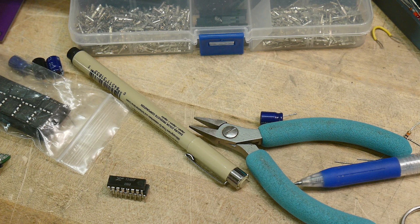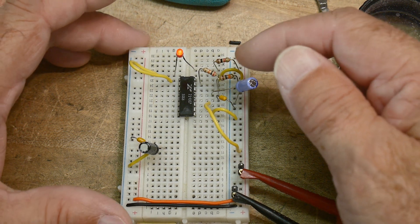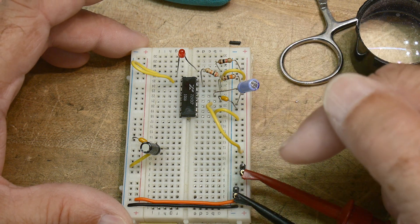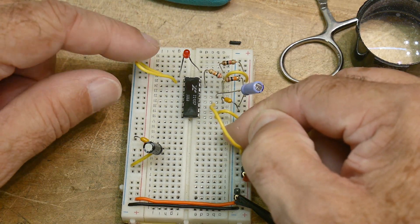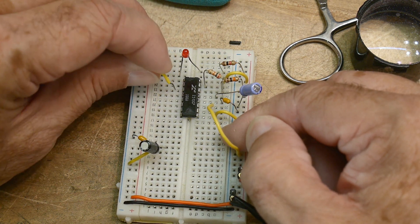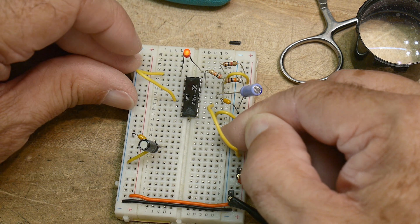Let's take a look at the circuit down here. I have a 10k resistor and a 10 microfarad capacitor as the master clock. I'm looking at pin 1, which is the lowest — least significant digit of the counter — so you can see the speed at which it's counting. If I move it to pin 2, it will be half of that, and then half of that, and then half of that again.